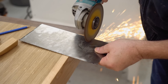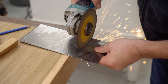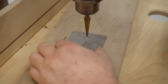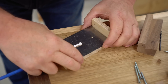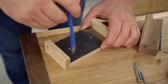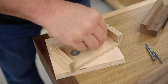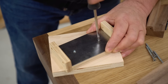The last part to cut out is the sheet metal plate that clamps the sandpaper in place. This is just straight cuts and then it needs two holes in the middle that will fasten it down to the pad. Then I can get the sheet metal fastened with the washers underneath and drive in the two five-eighths inch screws. Quick check on the other side to make sure that the tips of the screws aren't poking through.